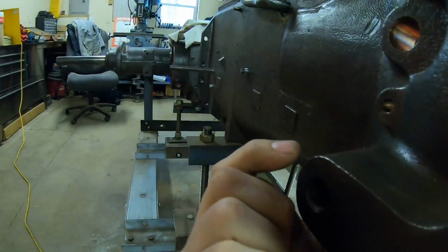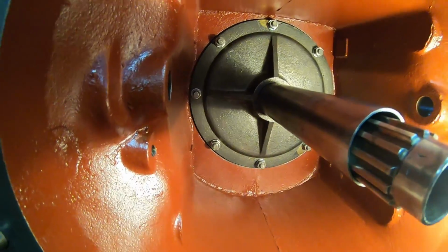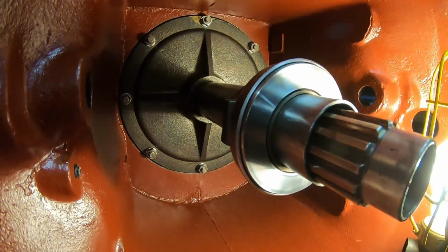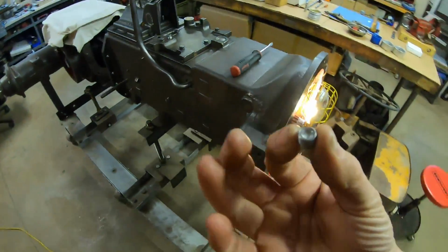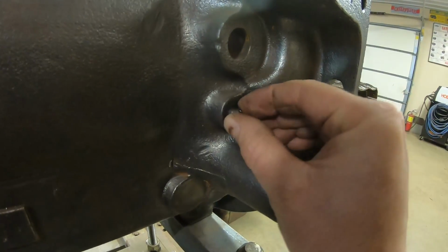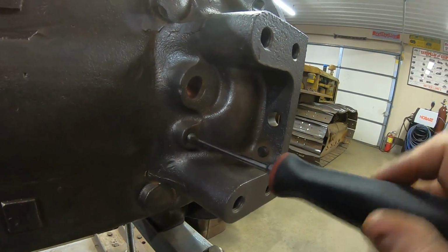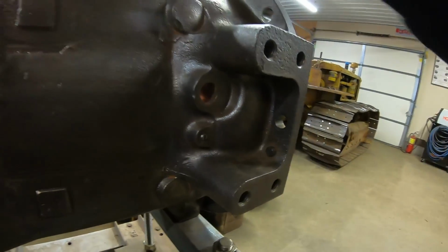So that is where a grease zerk would have been out here, and then the grease tube would have attached right there. It would have come over to the carrier, or it could have, I should say, because that slides on the tube that comes out right there, and everything would have been just fine. But all I found on the outside was this slotted head plug. So they had that blocked off right from the start, and if we can get pipe threads to start on camera, it's a miracle. But there we are. We're just going to get it put in right now because this is original configuration, from what I can tell, of this tractor, because this obviously never had a fitting in it.